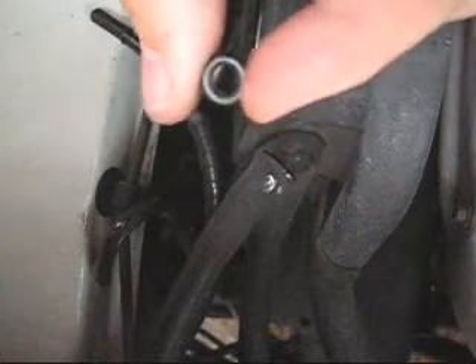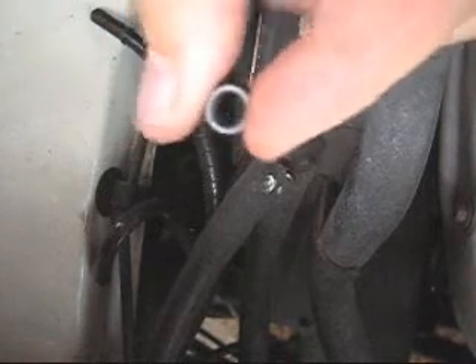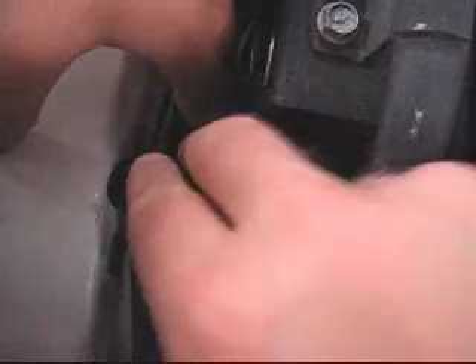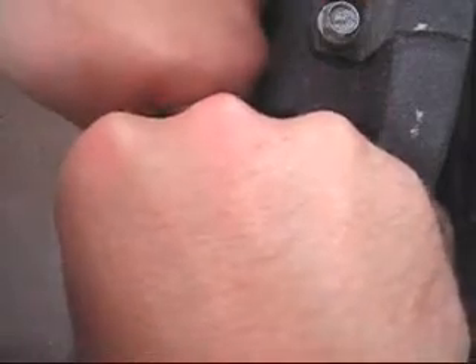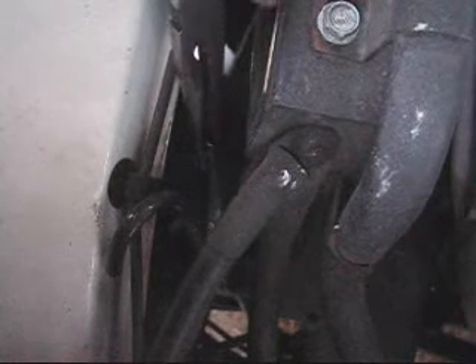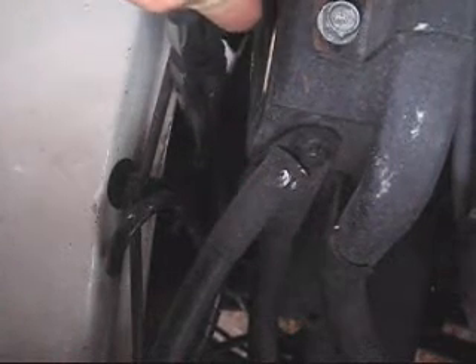To put the O-rings back in, it's a little tricky because they're larger than the opening they go into. You need to squeeze them a little bit, then insert them in that shape into the opening down there, and slide them down so they expand out perfectly level. I've put the O-rings back in and the collet back on. Now we're just going to very firmly insert the pipe back in — make sure you push it all the way down. If it's difficult to get at, take needle-nose pliers, gripping high enough to avoid damaging the seating area, and just push down until it's seated.